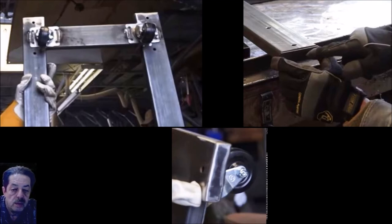Then use that four-and-a-half inch angle grinder with a flap disc or a grinding wheel — either one. Go around it, grind down your welds, make it look nice, pretty and round like in the bottom picture over here to the right. That's a way you can do this too if you're using flat, rectangular steel. It depends on what you find at scrap yards and metal supply stores, but you can also make them out of more angle iron.